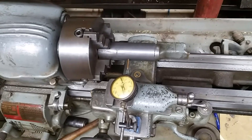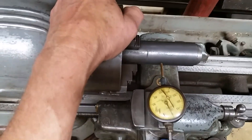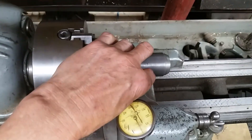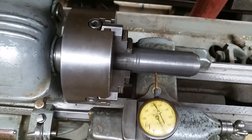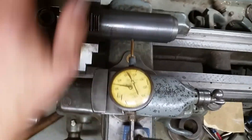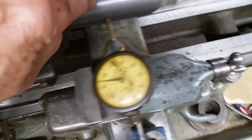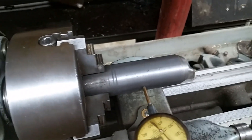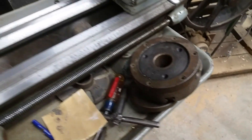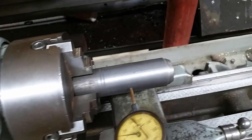Here is step one: I've chucked a really good-sized piece of shaft in there and got it about as centered as I could. I think my needle is sticking a little - I'm going to move it in a little and force it. You can see it moves just a little. So now I'm going to put a tool in and skim this just a little - just enough so that it is absolutely perfect and round. Then I'll put this chuck on it on the back.